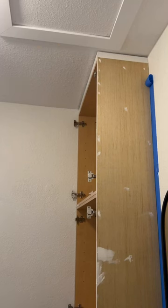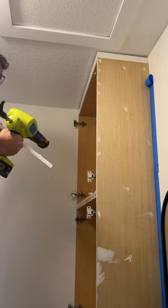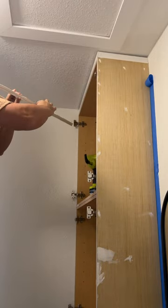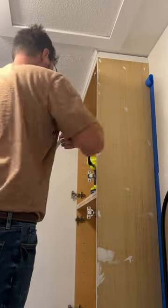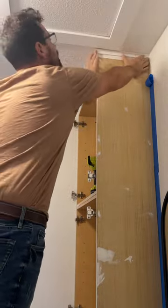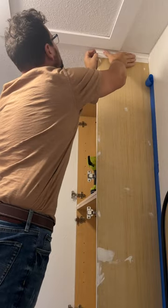I only had a couple of inches between the top cabinet and the ceiling, so I constructed a simple crown from two pieces of scrap primed trim I had lying around, which I glued to the top of the cabinet. When the glue set, I cut two pieces of cove molding and glued them onto the trim at the ceiling. It's a perfect custom solution for this small space, and the molding doesn't intrude upon the attic access panel.